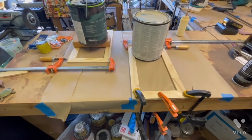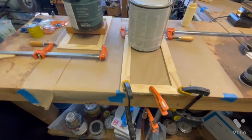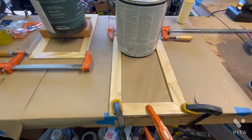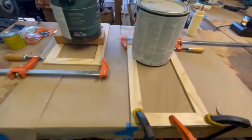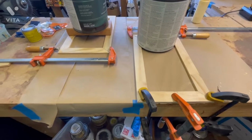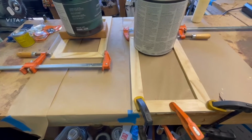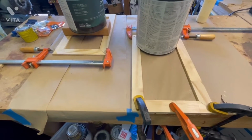Meanwhile, back here in the wood butcher's shop, we have two frames here that we have clamped as best as we can, using some paint cans and wood to hold everything square. And we've got one more frame over there, so that's all four frames. These last three frames, I went ahead and made these, the outside dimension is actually 14 1/4 inches, and that gives us that 1/4 of an inch inside width that we need to accommodate those new style grills.